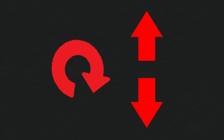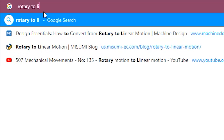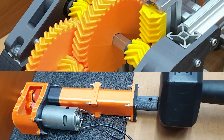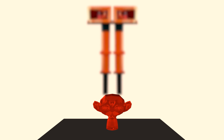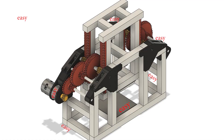To achieve this, we need to convert the circular motion from the electric motor into linear motion. There are many mechanisms for this — for example, a rack and pinion mechanism, a ball screw mechanism, or something else. I'll use a rack and pinion mechanism in this version, but the second version will probably use a ball screw mechanism.